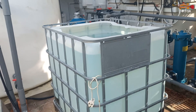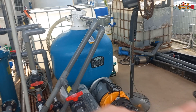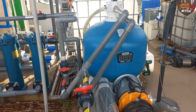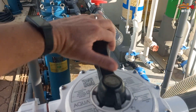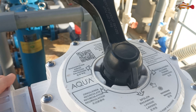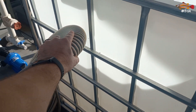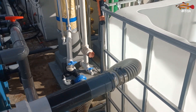There's one last thing about the system I'll share. We installed a pump just for backwashing our big sand filter, because we will run a marine-based system. Sand filters trap the dirt inside and we need to switch valves to do backwashes. Whenever you're backwashing you will lose water, and since we are not close to the sea I need to truck in seawater or make artificial seawater.